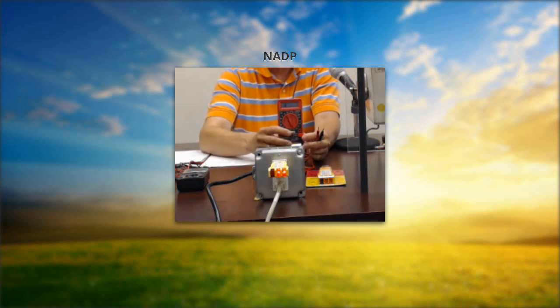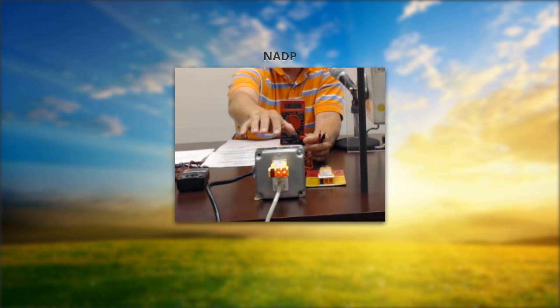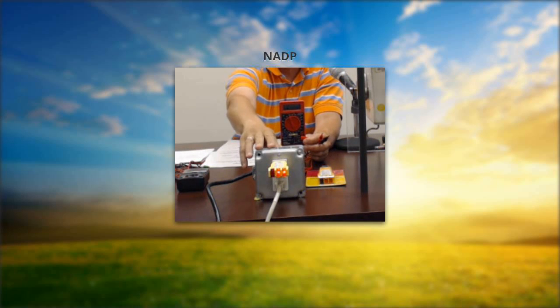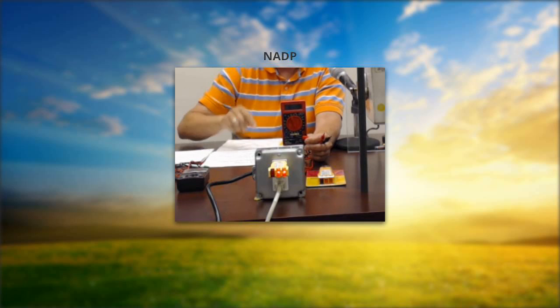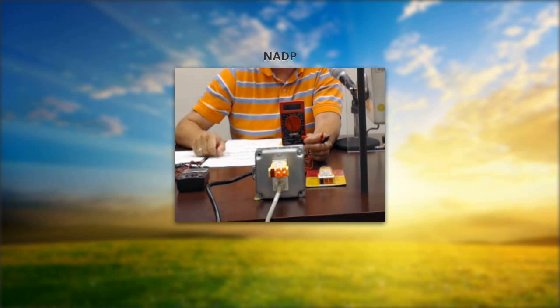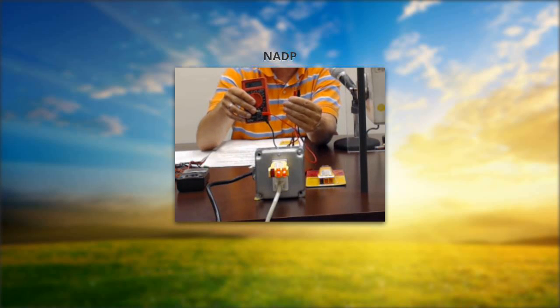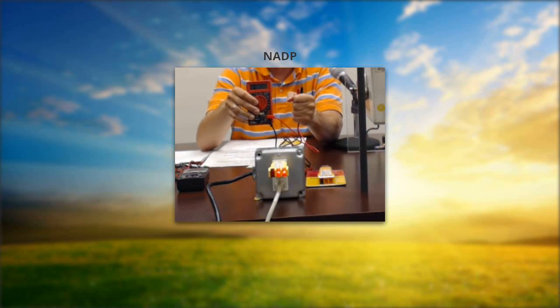The first exercise is how we measure voltage — I'm on page six of your handout. We've already discussed AC voltage, which is your house current — alternating current. Our batteries provide DC, direct current. AC voltage is typically the high voltage at 120 volts, and DC is typically the low voltage at 12 volts. When using the probes, be careful not to short things out — I generally hold them both in my hand to keep them separate so you don't have one trailing across and shorting something out.